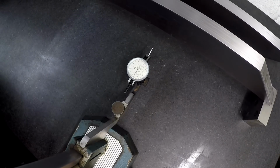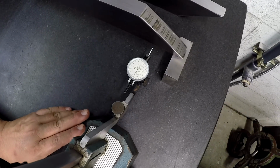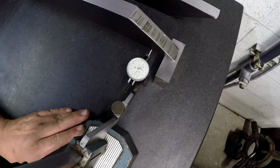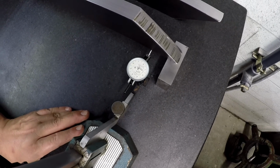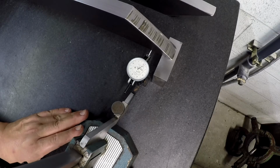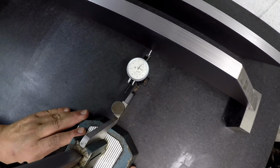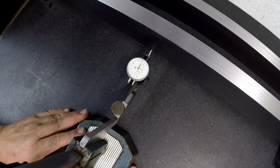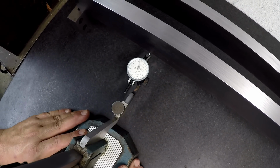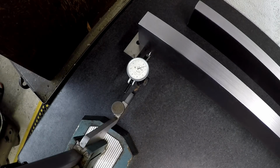All right, and I got you set up on my stand there, so you got a constant view of the indicator. I've already got it set, so we'll start on this end. And it's real jumpy because that's the surface finish of the part there. I did have it set near zero on that end. We're just going to call that a zero in that general area. It might have moved a little bit on me, but that is a tenths indicator as well. Let's go ahead and bring it down. I'll try not to jump off of it. So not too bad. It looks like we're looking at a half a thou so far. It's got little low spots here and there. And then we come right back to about where we started on the other end.